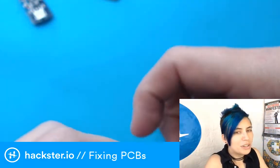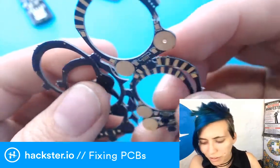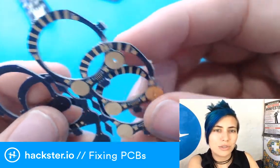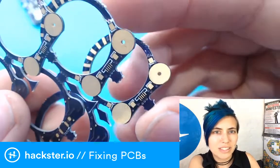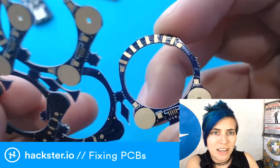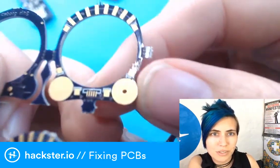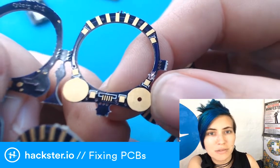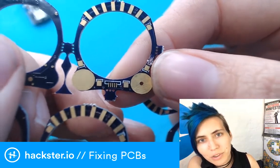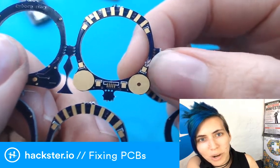So, what do we do here? I think I want to try this solder wick method. And in order to do that, basically I'm going to pick the least sort of traumatized one of these, which I think is going to be this one. And I already tested scraping off the solder mask with my knife, just to expose a little bit of the copper so that I could solder the two bits together. I'm going to have a little wire bridging the two.